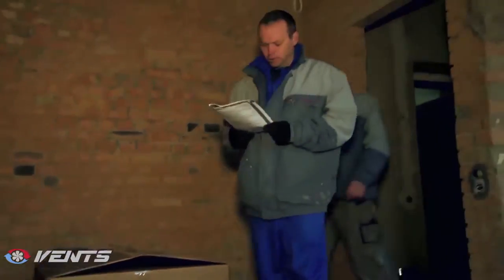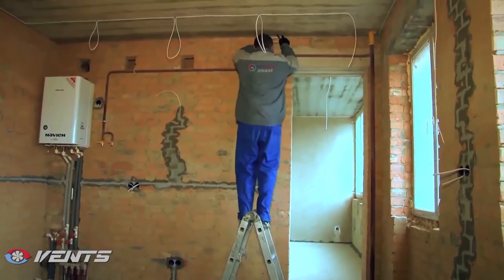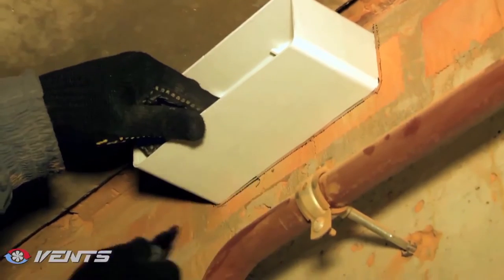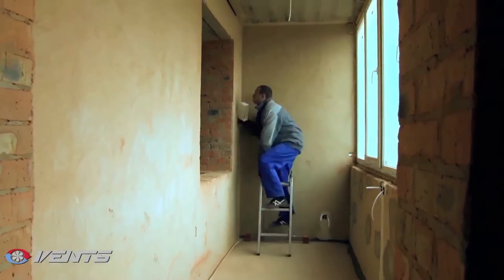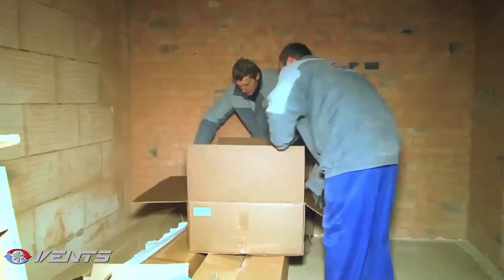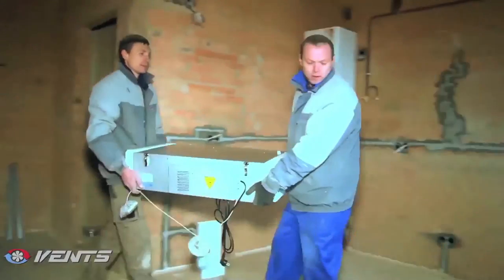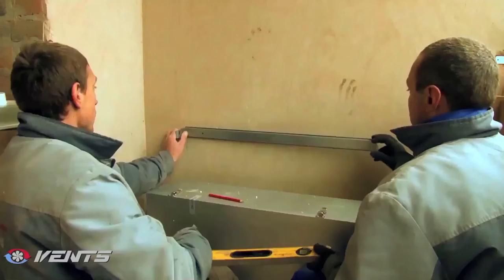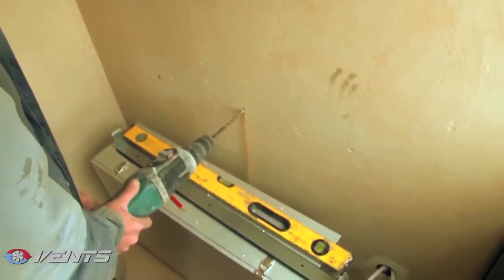It is best to install ventilation equipment in utility spaces where soundproofing is easily feasible, or above a dropped ceiling, in furniture or decorative enclosures to remain inconspicuous. This flat has a balcony which fits the bill. Since the balcony windows reach the ceiling, the air handling unit is installed on the end wall of the balcony and later hidden in a cabinet mounted below the windowsill level.